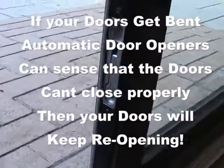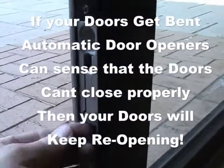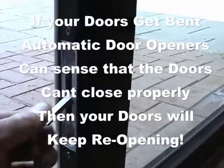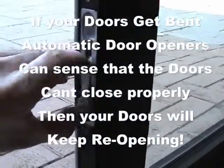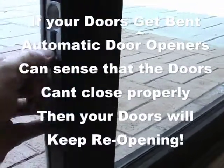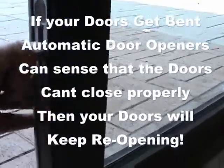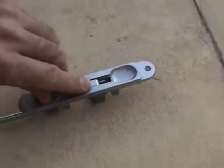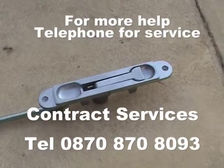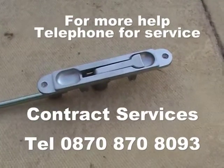You need to try and clear those holes out. It's usually the bottom one that gets jammed rather than the one at the top of the frame. If you can just clear those holes out and make sure there's no debris in them, you'll find that those bolts will go in a lot easier. Sometimes the door frames can have moved and that can cause a problem, but it's usually because of debris. So that's the importance of shoot bolts.